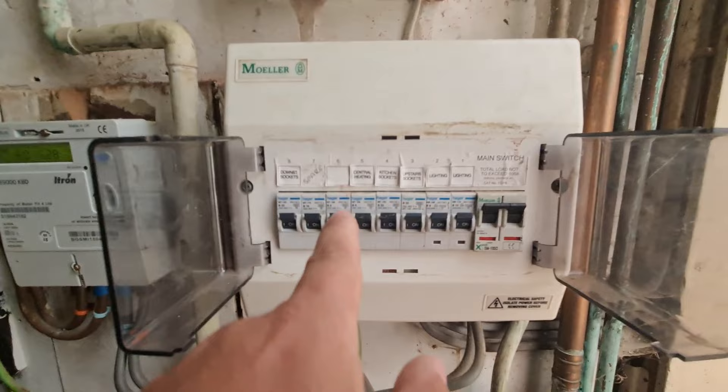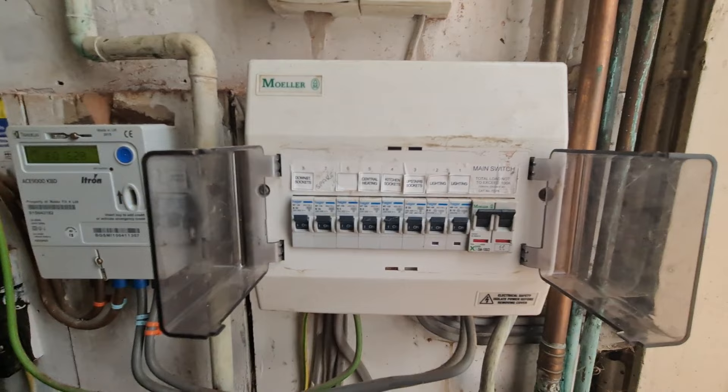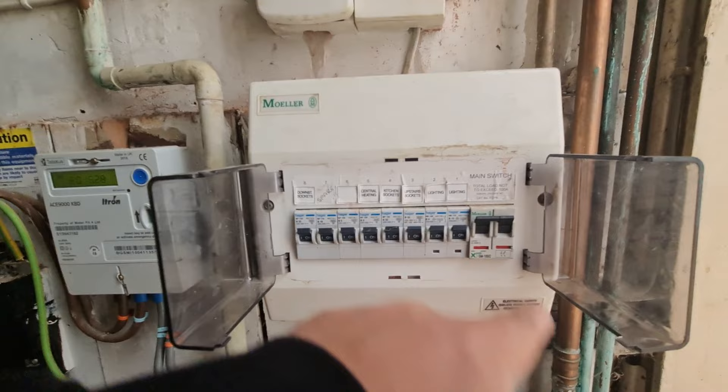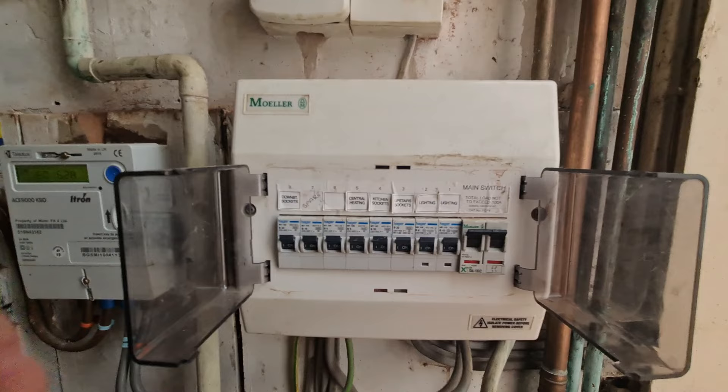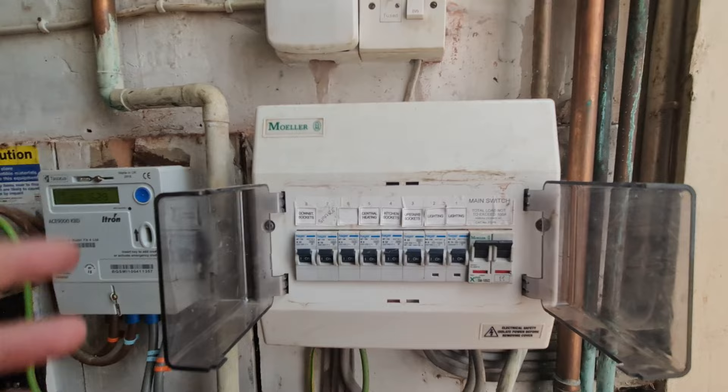Some people will just put things on a circuit at a time and go around with a socket tester to see what's on which circuit. I prefer to do it under dead conditions - you just link out your line and CPC and go off and gather your R1/R2s, seeing if you can obtain a value at whatever accessories you'd expect on that circuit. Then obviously when you come to do your functional testing at the end, you can see what is what and make sure it does kind of match up with what the dead testing and functional testing show you.